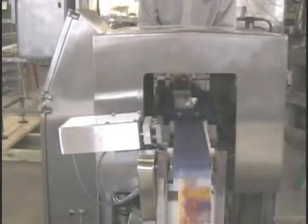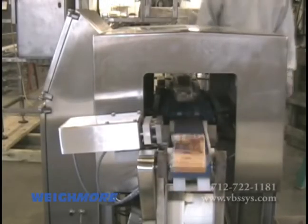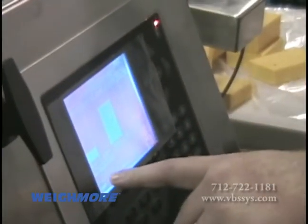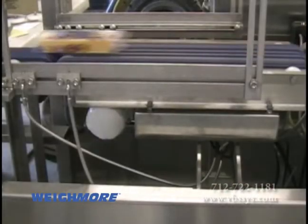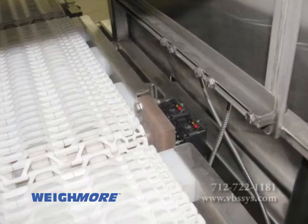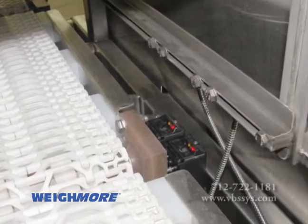If failed, the product is diverted, and depending on the frequency, it is reported back to the filling or processing machines for adjustment. Photo eyes and reflectors are suspended from overtop to prevent interference or weighing inaccuracies and must be kept clean for optimum performance.